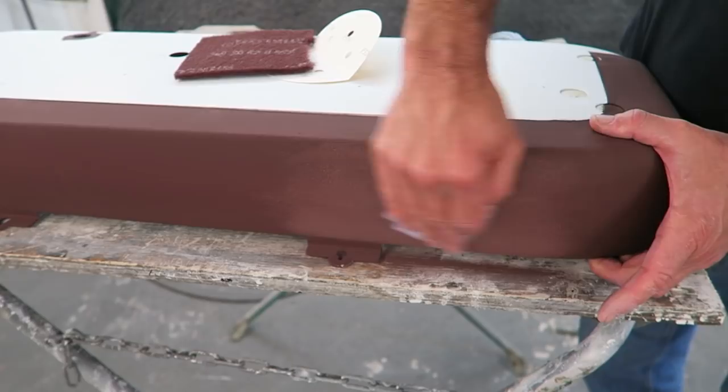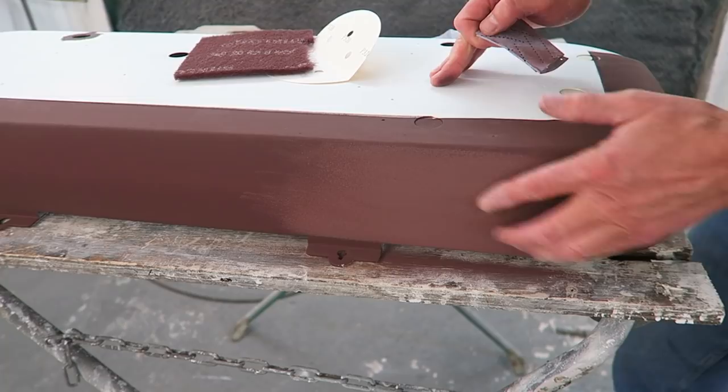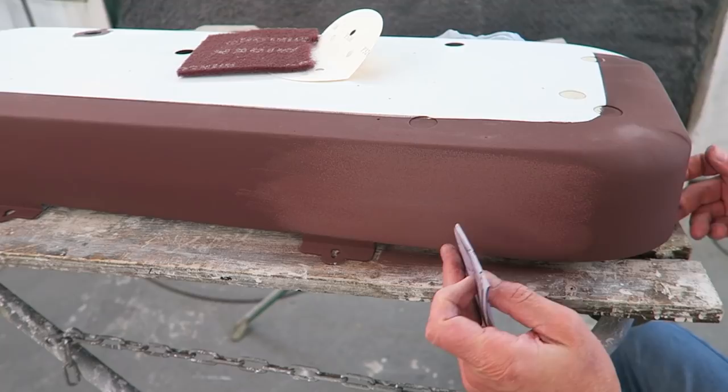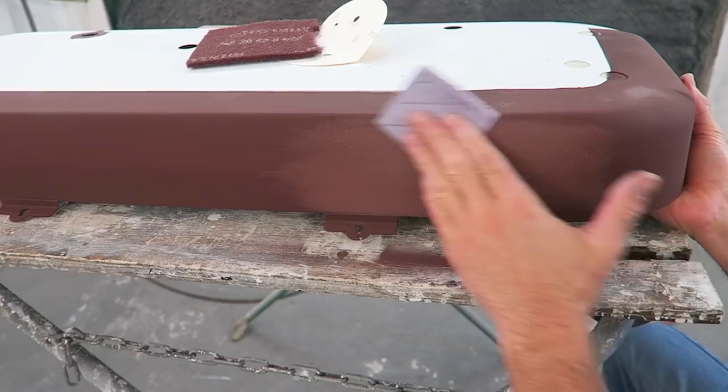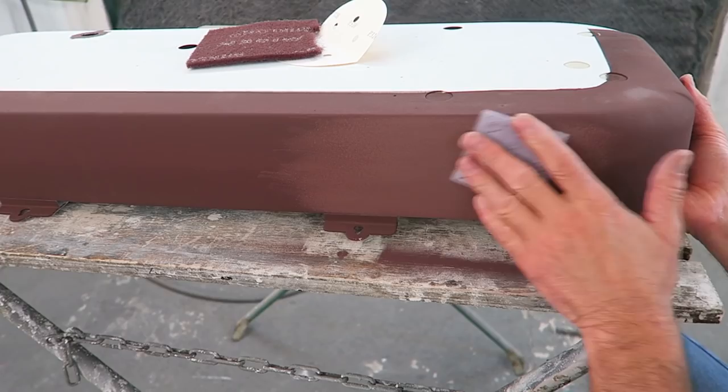And a 2.2 air cap in that. For anybody that does want to spray paint on, I prefer to spray things because I'm more used to doing that than rolling things, and you are going to get a more even finish. But certainly you need a bigger air cap than a standard spray gun. If you were using a top coat gun, it would be too fine, it just wouldn't come through the air cap.